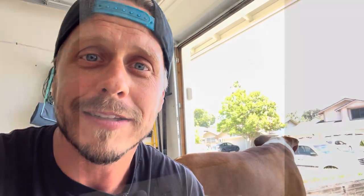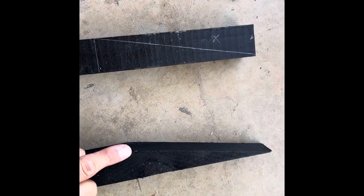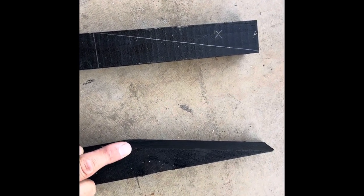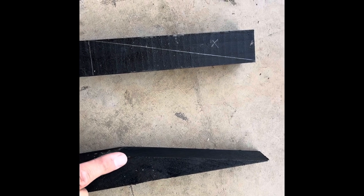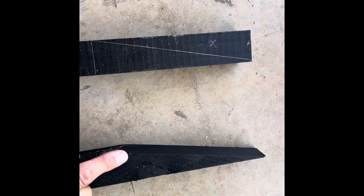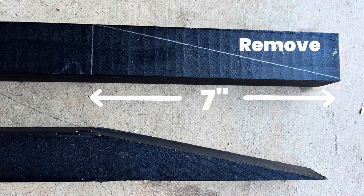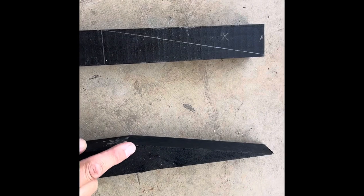There's only one part of this entire build that's difficult, and it's that very first cut. This is the top of the obelisk, and this is the angle we need on the legs in order to create a 30-inch base. I did some trial and error and came up with a 78-degree cut. Now, if you failed geometry like I did, you can use inches — just take a screenshot of this, and it will show you how to make that cut using inches.